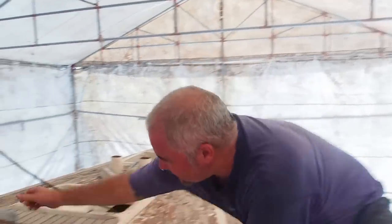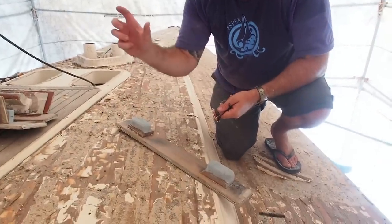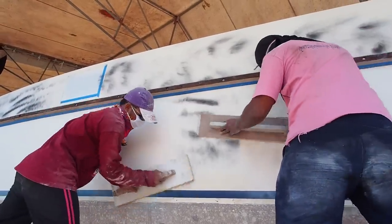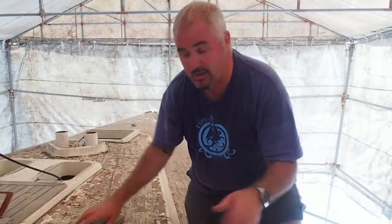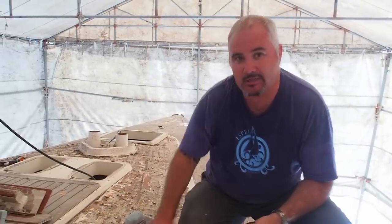Painters have been painting away, fairing the hull. They've been using long boards. It was a bit disconcerting because they start by getting black aerosol spray paint and they spray down the hull, then get the boards out and sand. The idea is that any imperfections in the gel coat, which they're gradually taking off, will be shown up by the black spray paint. The hull and topsides look pretty good after they've been faired, and next week they'll be moving on to the deck.